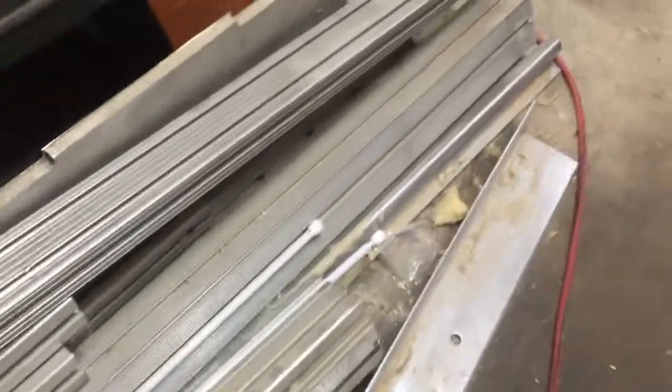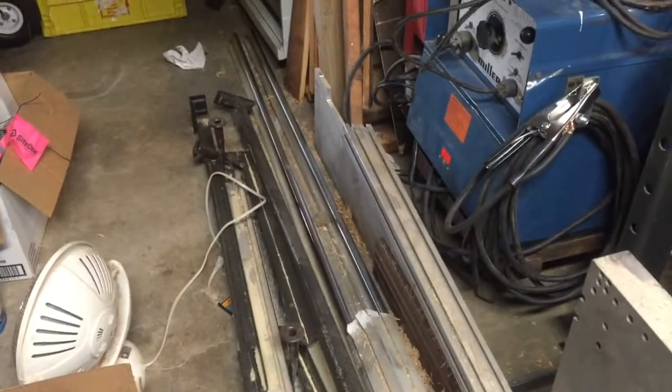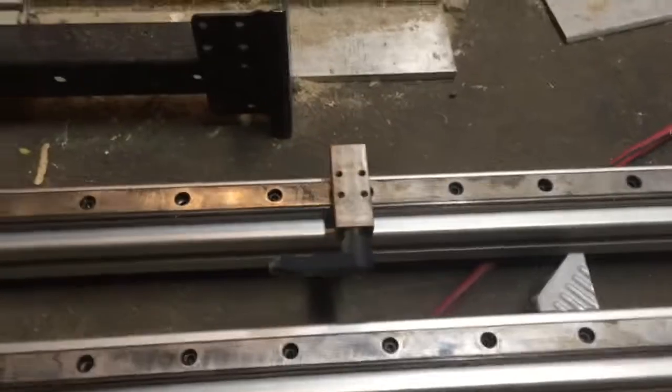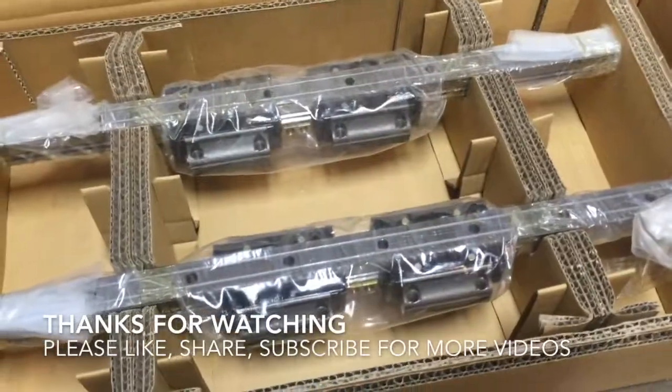The second one I'm thinking will have a bigger envelope — like 8x5 or 4x4 feet — as a CNC router. These linear guides you see here are 30-millimeter fully supported linear rails and they are 12 feet long, so I could probably build a 10-foot by 5-foot envelope machine. The long ones will be used for the X axis, and these 20-millimeter wide linear guides will probably be for the Y axis.